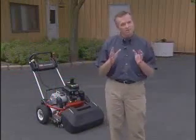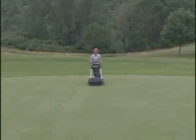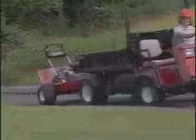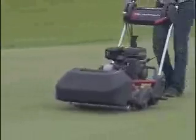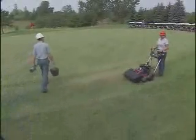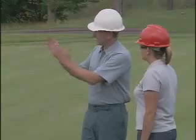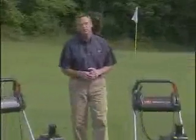Use common sense and remember the following points: Read the operator's manual — this program is not a substitute. Your Flex is a precision mower, so treat it with caution and respect. Drive slowly when transporting your mower from one area to another. Practice under supervision until you're familiar with the Flex operation. Most accidents are caused by speed, uneven terrain, not stopping the engine, and drugs. Use caution at all times and dress properly. Stop mowing when people are near the mowing area. Check the fluids and interlock every day before operating. Bring the Flex to your supervisor if anything seems unusual. Follow these simple procedures and your Flex will do everything you need it to do. I'm Bill Cooper — thank you for joining me for a look at the Toro Greensmaster Flex 18 and 21-inch mowers.